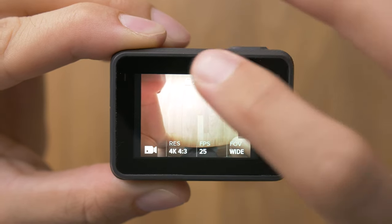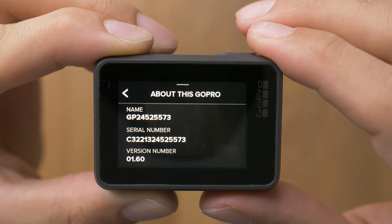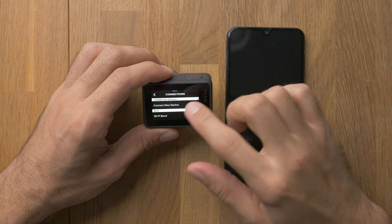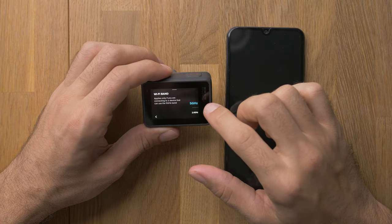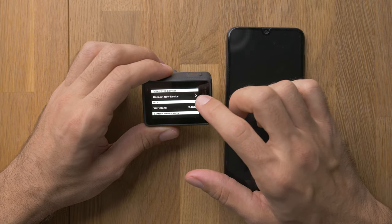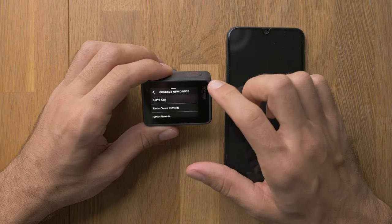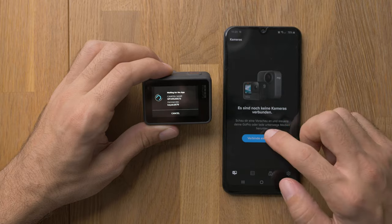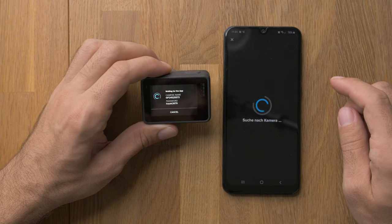Before tearing down your GoPro, please make sure that you have firmware 1.6 installed. I have just released a video on my channel on how to do this. The next thing you need to do is activate the WiFi. First you should change the WiFi band to 2.4, otherwise it could interfere with your FPV system, and then connect a new device and use the GoPro app. Because as we remove the screen of the camera, this is the only way we can adjust the settings.